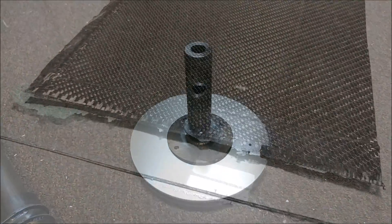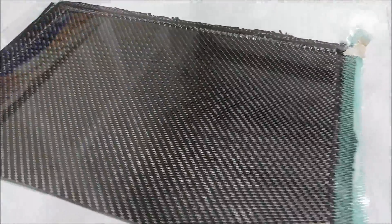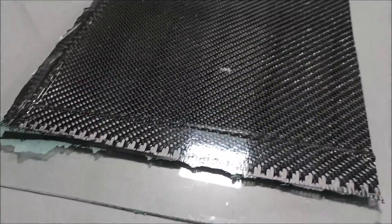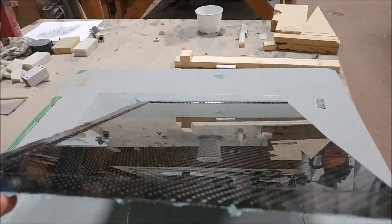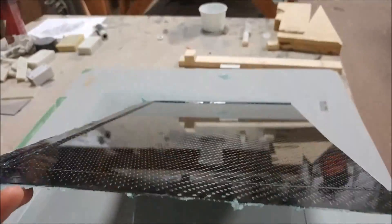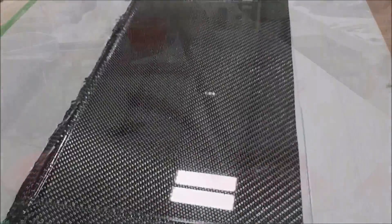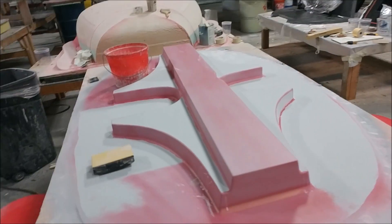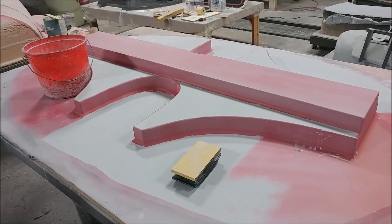Here's the result of half of the layup Jeff did. He's not super happy with it because the resin we used wasn't designed for infusion, so there are a few little pinholes and dry spots in there if you look closely. He's actually ordered some proper resin for doing infusion so we're going to redo that one. It actually looks pretty nice overall though. Friday afternoon Zach got pretty close to getting this one done — it's almost ready for waxing next week.